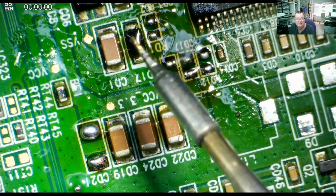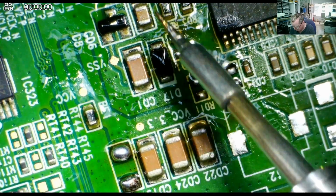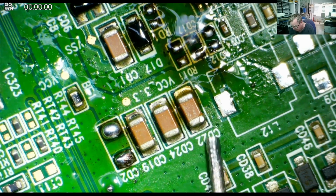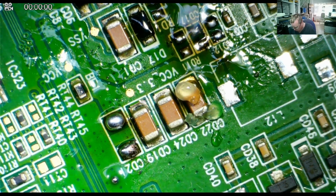It seems for some reason that when this is running at the low power 18 watts, the same as the other one, it struggles more. I don't know if it's whether it's a longer tip. We'll talk about it later, I think. Let's try on these big components then. So with the other iron we could do them, but we had to hit from both ends.